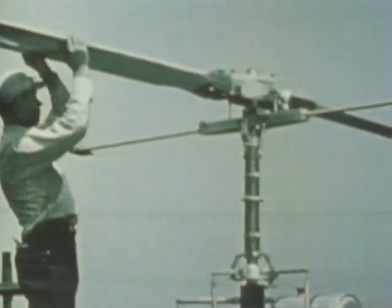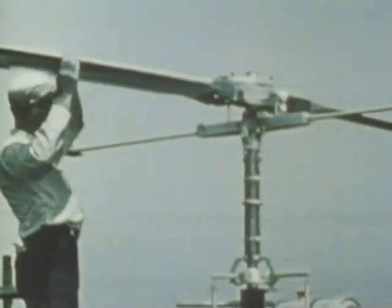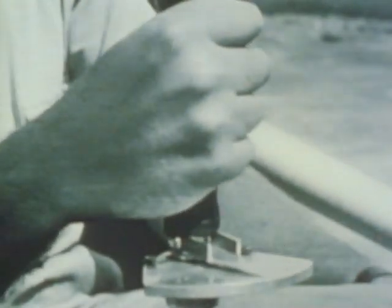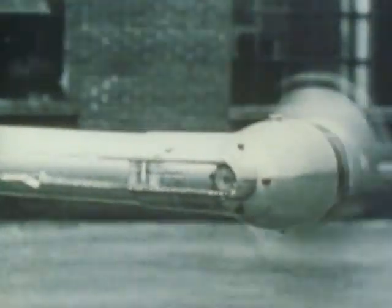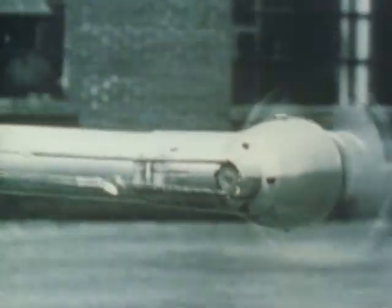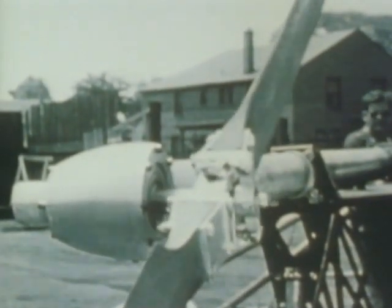Floyd is showing us the general structure, how the rotor is free in the seesaw direction, and what the general arrangement is. There's the throttle with conventional linkage to the carburetor. And that is the chain controlling the pitch of the tail rotor with an Acme thread when he moves his left hand horizontally. That shows the tail rotor with quite considerable over-design, as the parts are very massive.